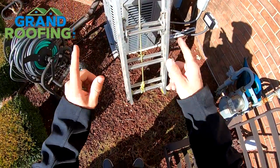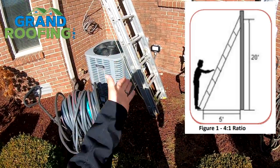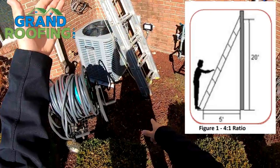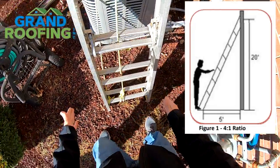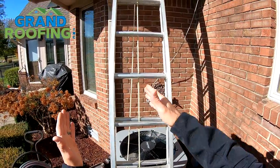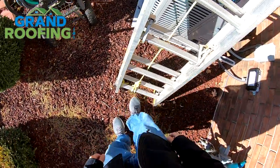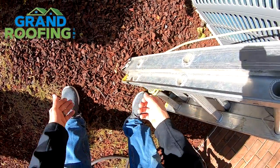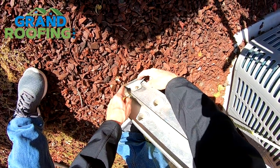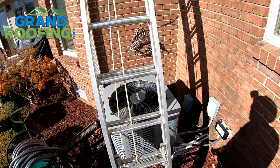Now that I've got my hands free — and that's going to be a very important OSHA rule in a minute — you want to make sure the angle of the ladder is sufficient so it won't kick back on you while you're on it, but also not too steep so the base kicks out. You want both feet in contact so the ladder is vertical. You don't want it crooked because as you go up, your top-heavy, off-center gravity will cause you to fall off. Make sure both feet are secure. You can sometimes use ladder extensions, a piece of wood, or take your foot and make a cleat, rocking it back and sticking it into the mud. You don't want it slipping.